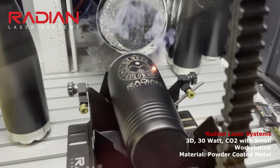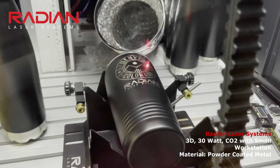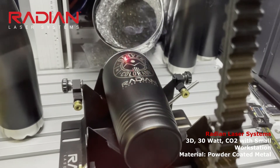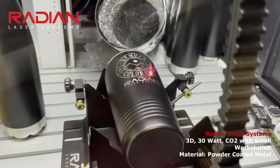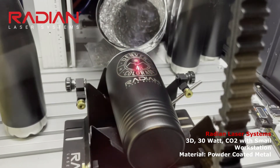This particular system was built with a 30-watt CO2 source, but we also build systems with 60-250 watts. The typical 100-watt system that we sell is easily 5-10 times faster than a flatbed. What takes 3.5-4 minutes on a flatbed might only take 15-30 seconds on a Galvo-based system.